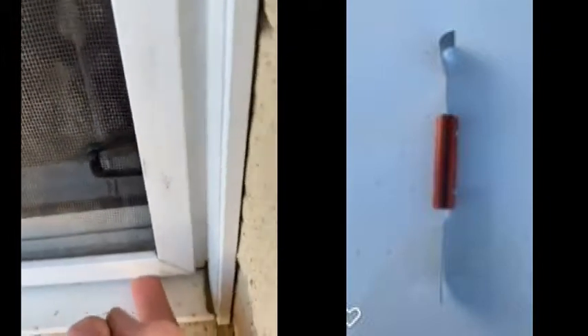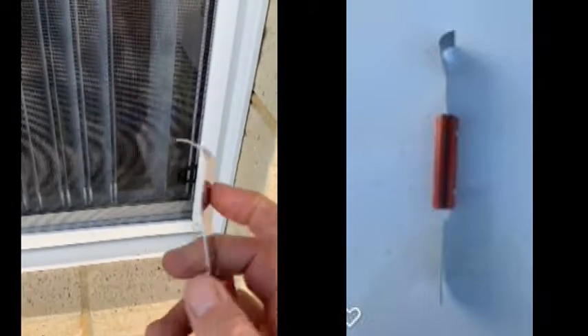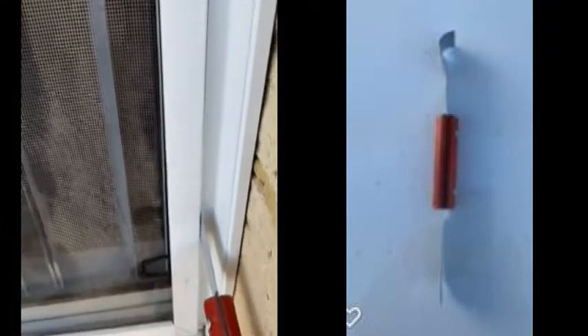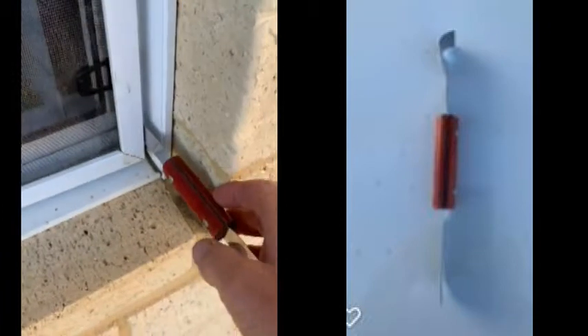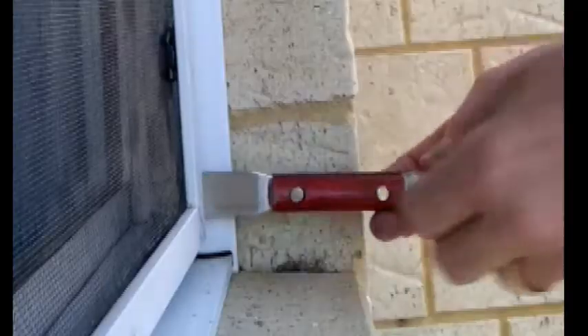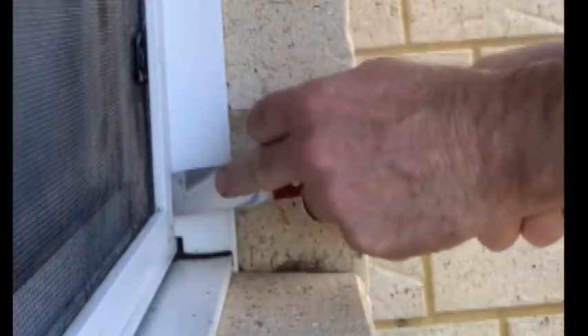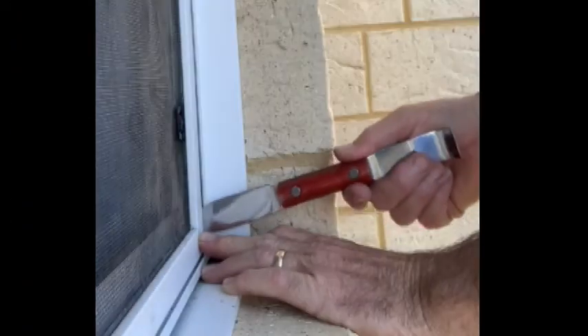Right now, putting the screen back in. As you can see here, it's quite tight — it hits there. It's okay as you go up towards the top, but as you come to the bottom it's tight there. It's pushed up as far as it'll go this side. So what I'm going to do is use the shimmy tool again on the other side of the screen out tool. I'm going to put that in where I can get it and shimmy that down to the bottom where it's tight and literally hold it in there. Now I'm going to push on this part here and shimmy it in. As I'm putting pressure on this, all I'm going to do is wiggle this and that will slide over the stainless steel — so nothing gets scratched. It's very smooth, very thin. That just pops straight in, gets pulled straight out, pushed back in and down.